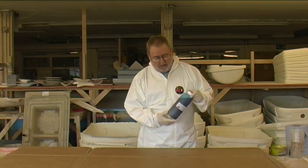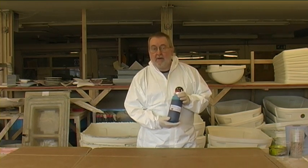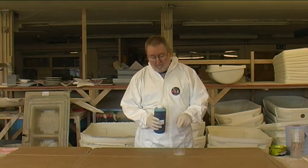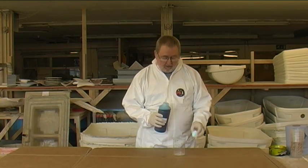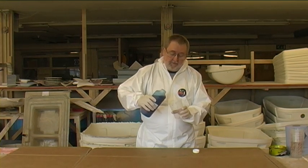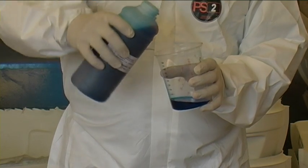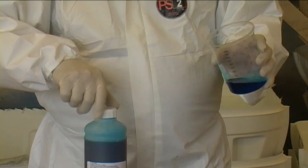This release agent forms a film. You spread it on in its liquid form and the alcohol evaporates to leave behind a continuous film of PVA. It's deliberately coloured blue so that you can see where it's been. I'll just pour it out for you so you can see its consistency — it's not all that thick and it does run, so when you're putting this onto the mould surface be careful. The blue colour enables you to see if you've missed any areas; that's why it's tinted.